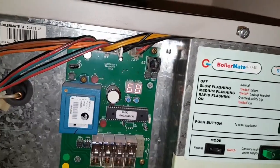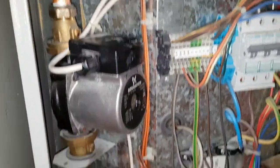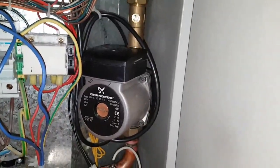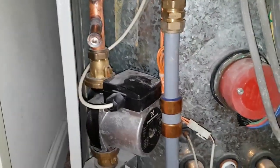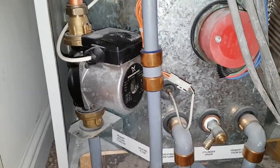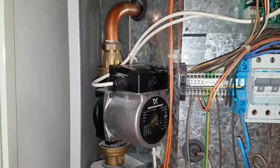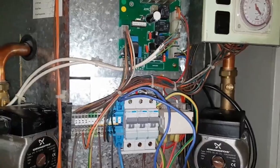A few people have been looking at this boiler and just turned away when they've seen what's involved - it's quite complicated. You've got three pumps. One is for hot water - it pumps into this hot water heat exchanger, looks like a combi. One is a primary pump that pumps between the boiler downstairs - the Glowworm - and this cylinder, so it heats this cylinder like a thermal store. The other pump is for central heating going around the radiators. So you've got three circuits within this one unit.